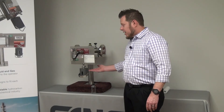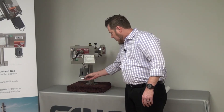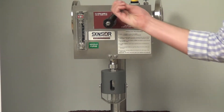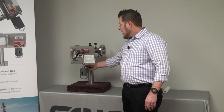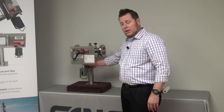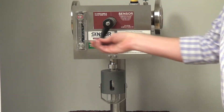With the use of our adapter and needle technology, the operator can simply install a bottle, put the strap down, and take the sample directly into that bottle. As the bottle is filled, all of the vapor and fumes coming off that sample are directed out the vent, where they can be sent to a flare, a low vapor pressure recovery area, or a safe location.